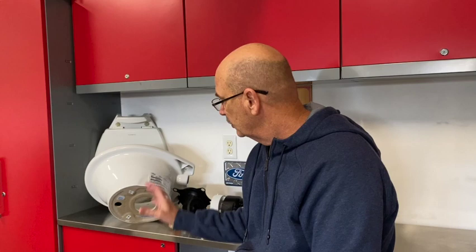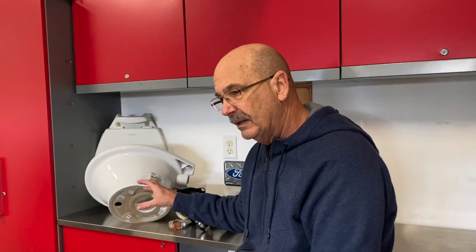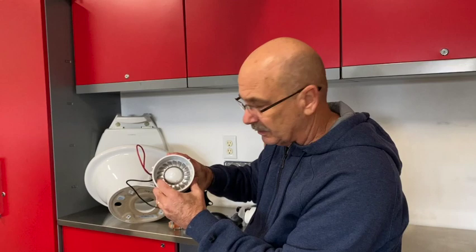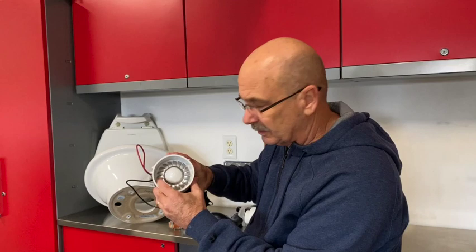I don't recommend drop-in pods or tablets in this toilet. If you flush immediately before those drop-ins or pods are 100% dissolved, they can easily damage the impeller, seize the pump, or get stuck in the discharge tube — and you'll have a real bad day. There are plenty of good powder or liquid tank treatments that will do the job without hurting the toilet or the impeller pump system.